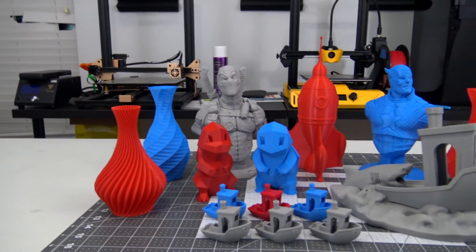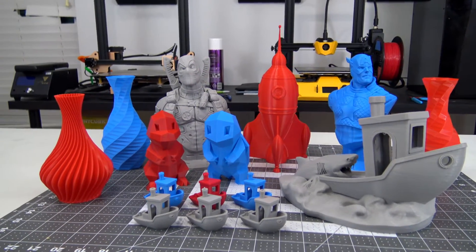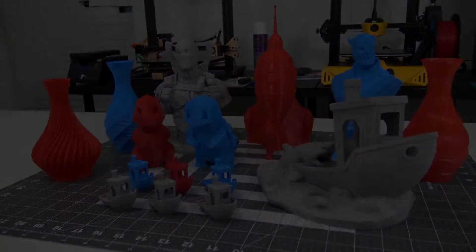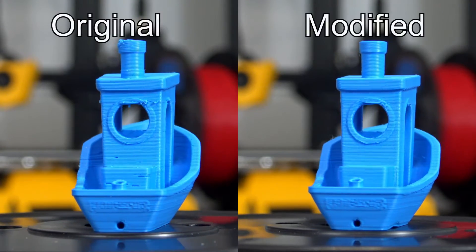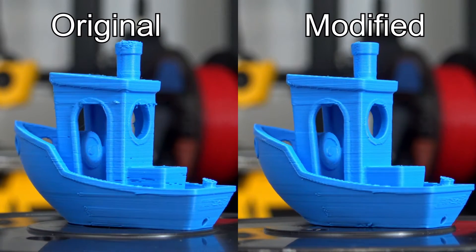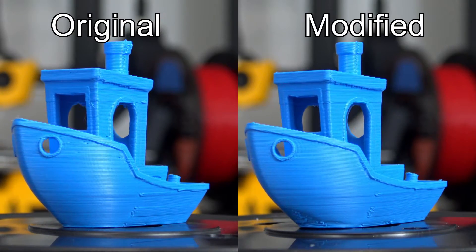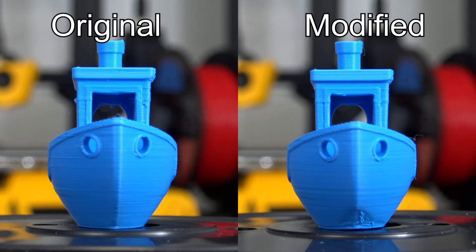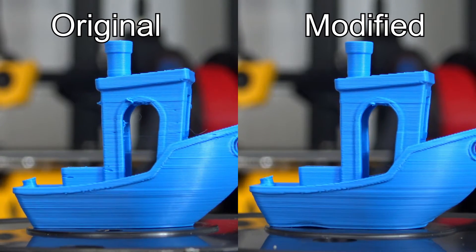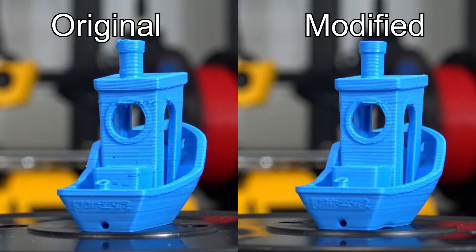A printer can be stylish and quiet, but it's no good if it can't print well, so let's look at what I've printed over the last couple of weeks. Unless otherwise noted, all prints are using PLA, and you can check settings and filament used at my 3dprintlog.com page linked in the description. First up are the customary 3D Benchies. On the left is the Benchy with the supplied Cura profile, and on the right is after tweaking the settings. The original profile had six millimeters of retraction, which was way more than needed. I cut that back to 2.5 millimeters and still kept stringing to a minimum. That large retraction was causing under-extrusion and gaps in the print, particularly noticeable in the back box of the 3D Benchy. After lowering the retraction distance, those gaps are gone. I figured this out pretty late in my testing, so unfortunately this issue reappears in some other prints I'm about to show.